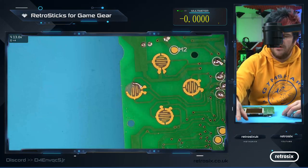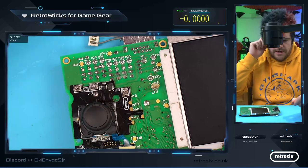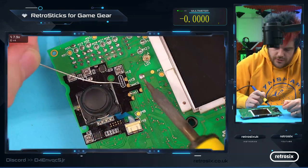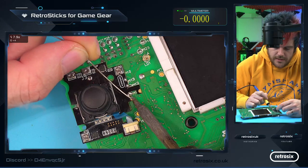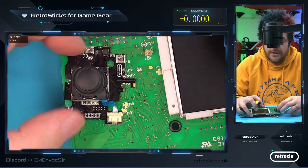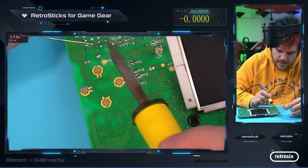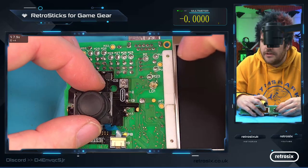So we're going to install this on the one chip. And it couldn't be any simpler. I will start by getting some solder. I'm going to pre-tin the pads. I don't need that one. Pre-tin that. Pre-tin that. So ready, done. There we go. Pre-tin the board pads as well. And the 5-volt. And now place this on here.